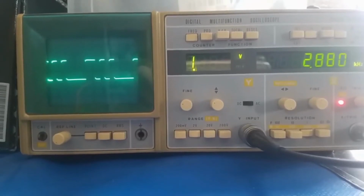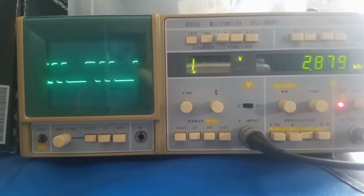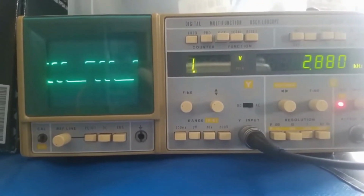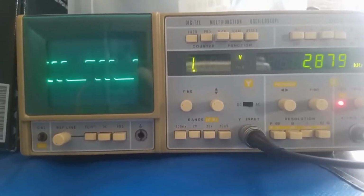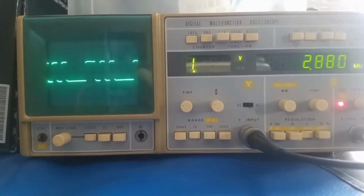In case you're wondering how we managed to communicate with the Raspberry Pi through that dongle and those 3 wires, what we are using is a UART. And what happens in this protocol is that you set a baud rate, and both devices then take charge of sending bits at that rate and reading bits at that rate.